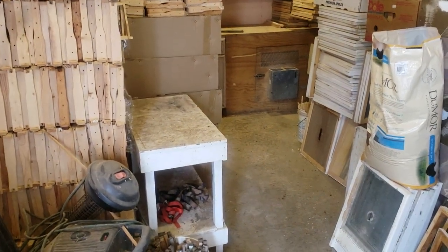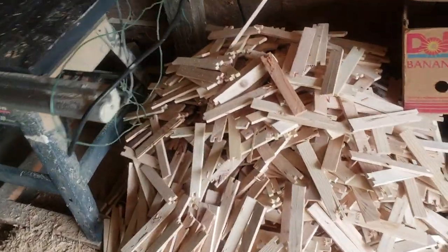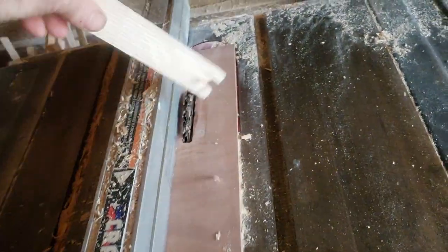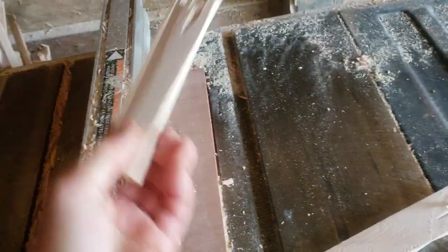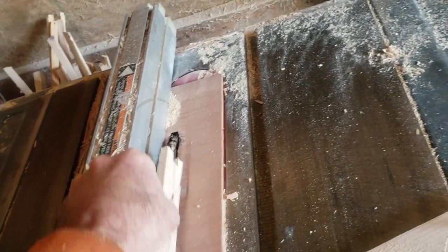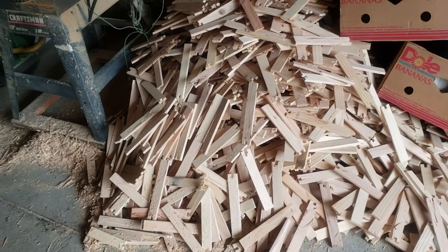Let me show you what I do during the winter with my table saw. During the winter, I'm not spending time pulling weeds in my garden or out in my clover. So I have time to cut frame parts on the table saw. I put in a stack of 8-inch saw blades and cut out like this right here — this is set up for the top of the frame. That's the top, and then this is the bottom groove. The last cut I make, I move this over, put a piece of underlay mitt down, and carefully go over that saw blade flat to a certain point, and that puts the taper in it. Those are all deep frame parts — there's probably a few thousand there. I could probably make a thousand frames out of those.